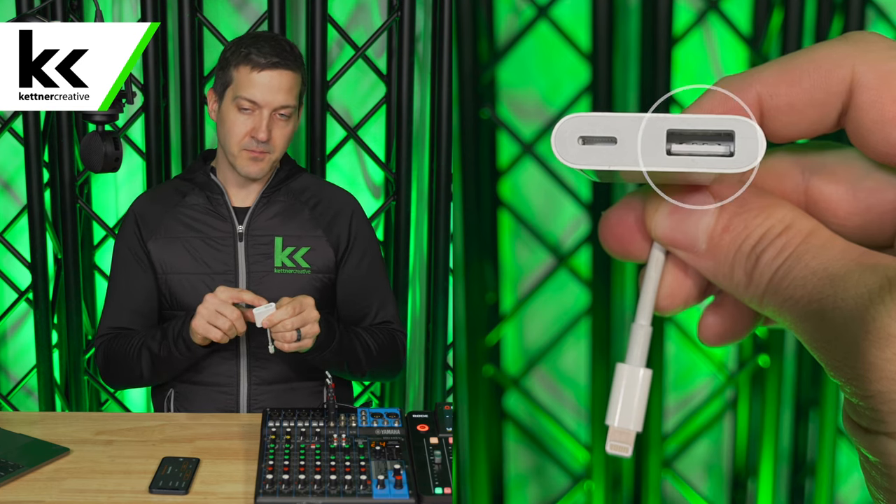We covered a lot of ground in this video. We showed you two ways to connect your phone to your audio mixer — using a DI box or going straight in with a headphone to dual TS cable. And to connect your audio mixer back to your phone, we used the headset breakout cable, connected directly using USB output, used the iRig Stream which is probably my favorite solution, and connected an external high-quality audio interface directly to the phone — that's the best highest-quality result but also the most expensive. If you have any questions, please leave a comment below. If you're looking for pricing or specs, we have links in the description. If you want to see more videos like this, please like and subscribe.